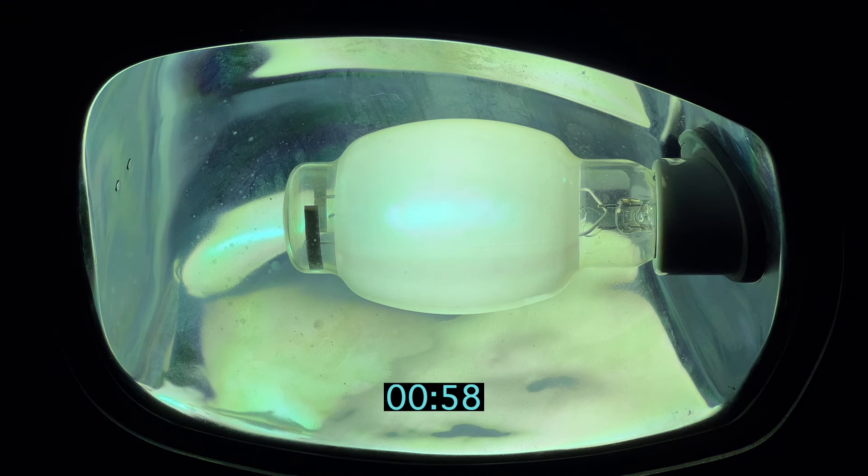Before we let it warm up, we're at 119.3 volts, 0.81 amps, about 100 watts, and 0.98 on the power factor. A little late at presenting that — I apologize, usually I do that right after turn-on, but I was just admiring this bulb. So now we will let it warm up.